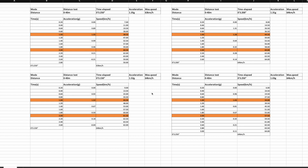That's a possibility. When I first ran this one, to give you an example, I accidentally forgot to connect the sensor cable, and it was a 3.8. So that's how much difference the sensor cable did, just because of the timing. It was cogging in the beginning. So that could be why this one is faster, and that could be why this one is slower. Just the way the motor happened to be aligned at the start. That will make a difference.